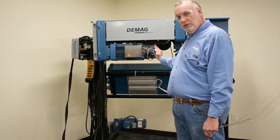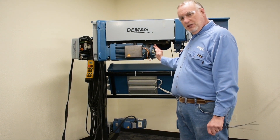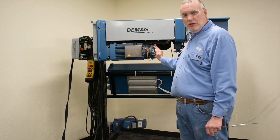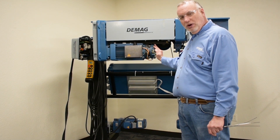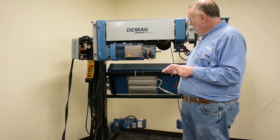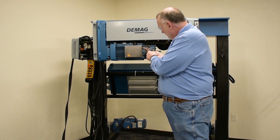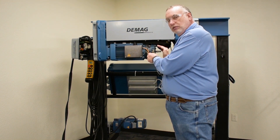The published minimum air gap is .35 millimeters, but on the DR-PRO hoist we always sacrifice a little of the low end adjustment, and I'll set this air gap to .40 millimeters using a feeler gauge. I'll check the air gap with the feeler gauge to begin in this area here. Always good to check all the way around the perimeter.